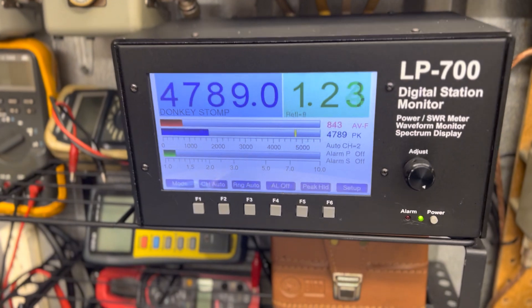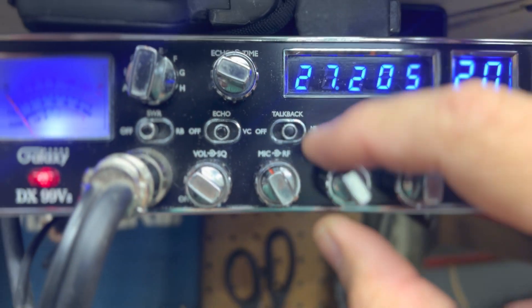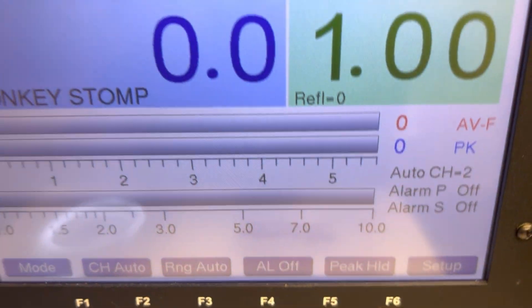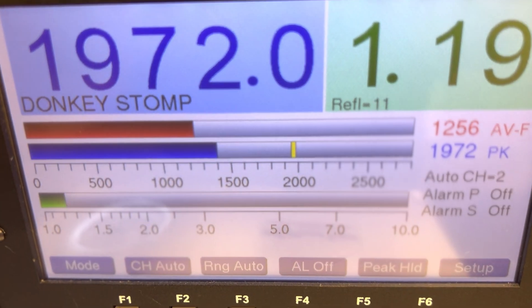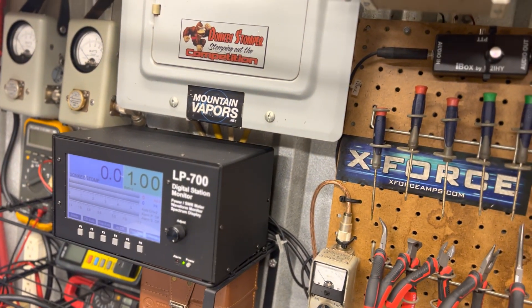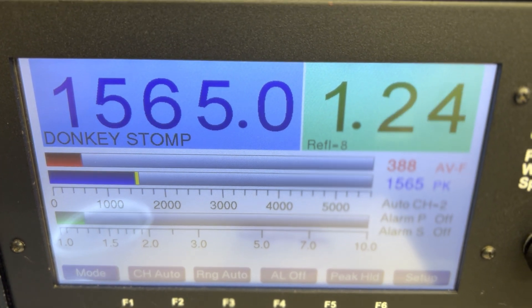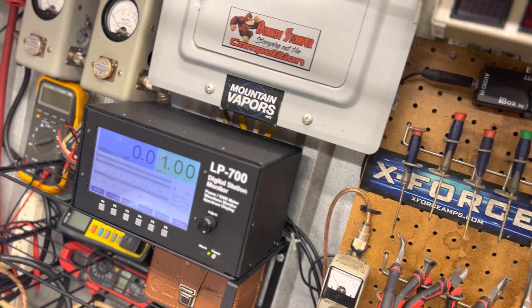Now I'm going to show you something — this is what I tell everybody not to do. Watch this: I'm turning my dial wide open on sideband. Now watch that average number — this is why linears break more on sideband or amplifiers. You see that power draw? That average just draws a lot. It's better to just run it down like you did on AM. When you've got sideband, let it chill. That right there, guys, is why it's just harder on the sideband. That's why I like to keep it turned down.